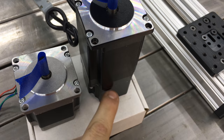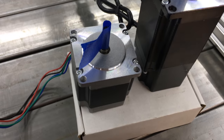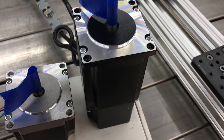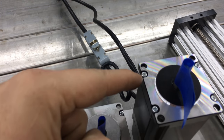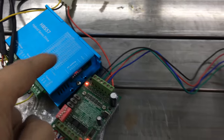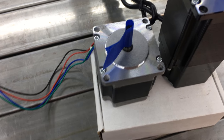If you've never heard of these types of motors, there might be a reason for that — they're more complicated. The normal process is: control board, motor. The hybrid servo motor process is: control board, another control board, motor. And there's also an extra power supply just for the motor. These are sometimes called a closed loop stepper motor. Closed loop means the information comes in, it does its thing, comes back out — so the board knows it's counting the steps as it's making them. A regular stepper motor is an open loop type, meaning it just gets the controls sent to it with no feedback whatsoever.